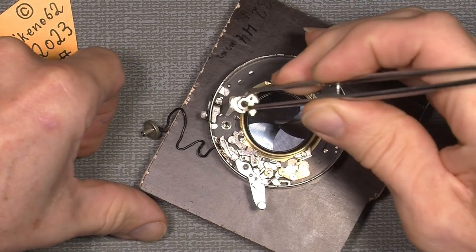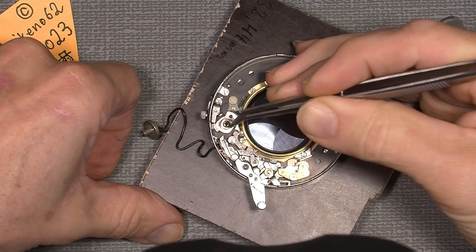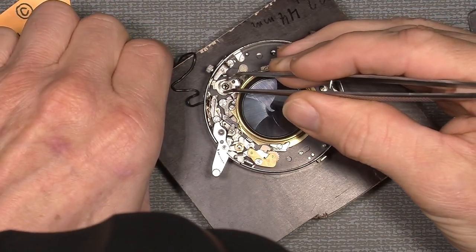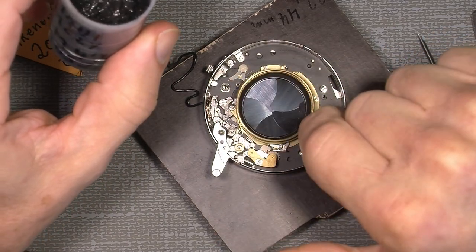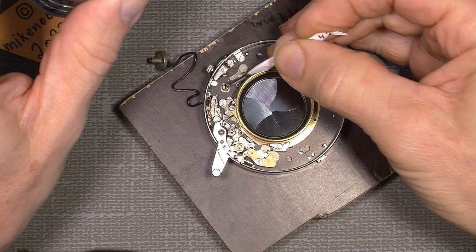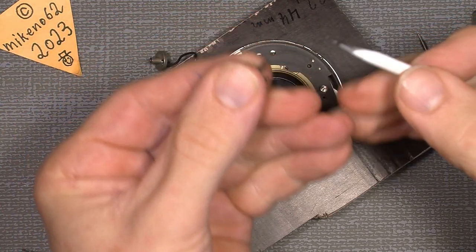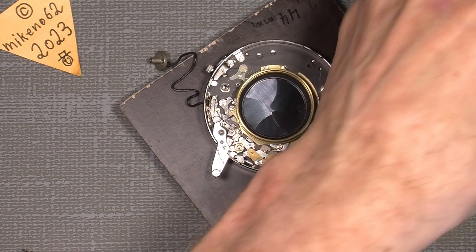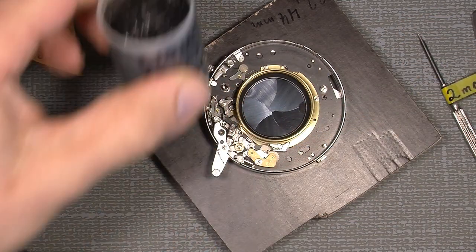That's part of the cocking gear, and it has to sit in here. That way. And it also has a spring. I mean, we have to do some lubrication. Because I've already been through the whole process, I will just add a very tiny amount around this axle here. And also, which is also important, I will also add some lube on this, the gear for the cocking that's connected to the cocking ring. So I already lubed it, but it doesn't have to be much. So I add some Liqui Moly, LM47, in my opinion a good grease for that.